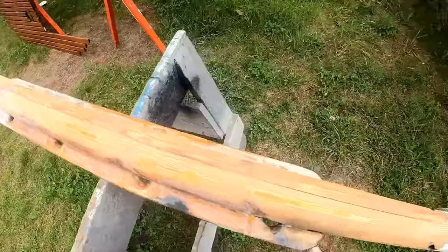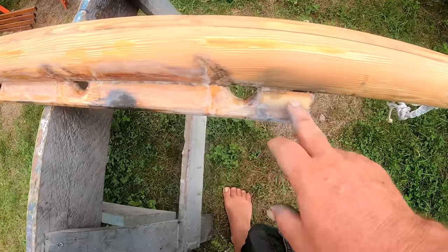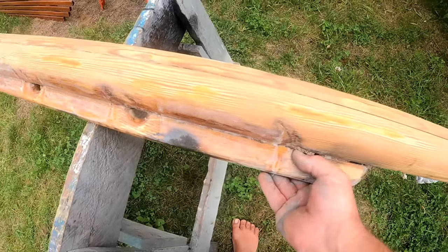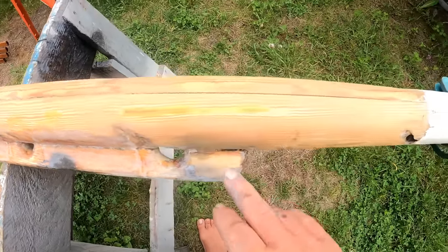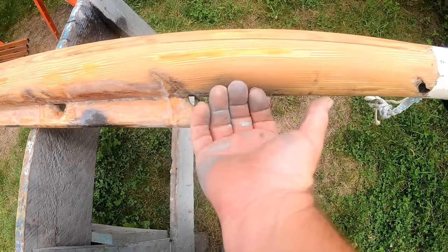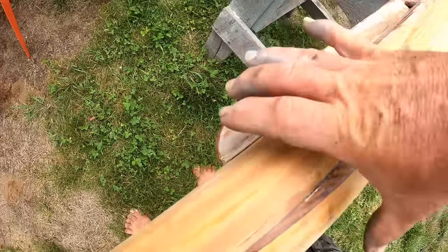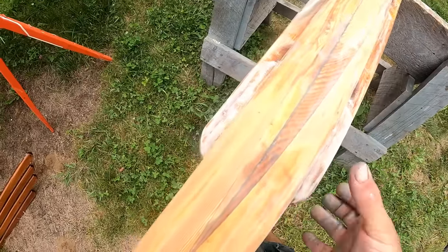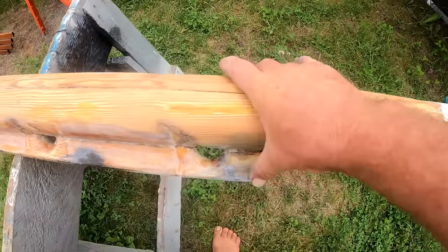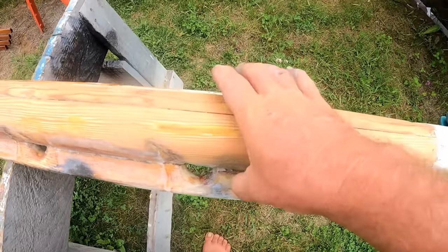It looks like it's finally got dry enough weather to put some epoxy on. The first repair on the boom is to fiberglass these reefing combs on just to reinforce them, because there's a lot of strain on here. Not surprisingly, right at the ends the fiberglass was delaminating — you can see it right here. So I'm going to re-glass this and wrap all the way around the boom, because the ends are taking the most strain and have the least amount of support.